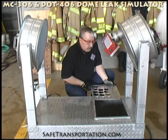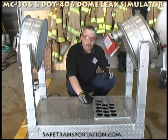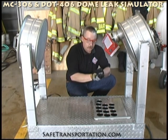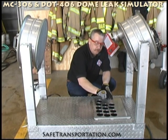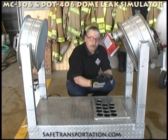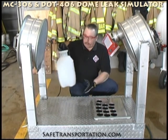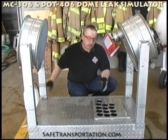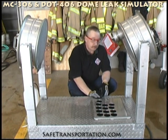Some safety precautions to look at: eyeglasses — we are drilling through a metal object, so you want to have eye protection on. You also want to have hand protection on. We're also going to keep the hole saw clean when we're penetrating through the aluminum, as the kerf will tend to load up with aluminum filings. So we're going to bring in a pressurized water can or a booster line to keep that drilling process clean of any aluminum filings.